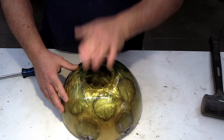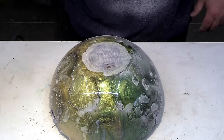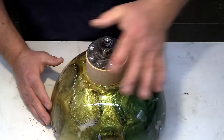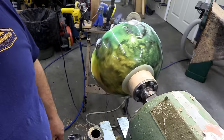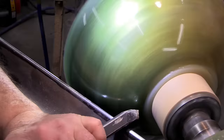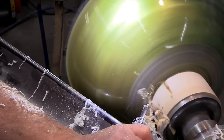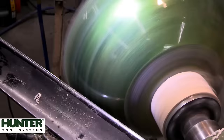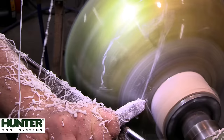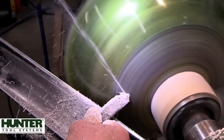Let's clean up the bottom and get a glue block on it to get this on the lathe. Using the cutoff sanding disc to grind a nice flat spot on the bottom so we can stick on our waste block — that's been dipped in hot melt glue melted in an electric frying pan. I initially started with the number three Hercules from Hunter Tool Systems but switched back to the 5/8 bowl gouge to clean up that area, then we start stripping off the excess epoxy to see what we're dealing with.